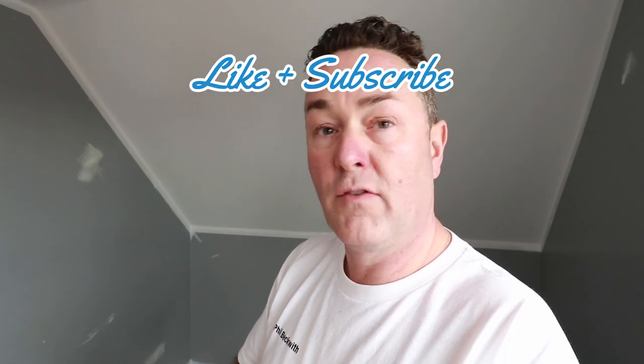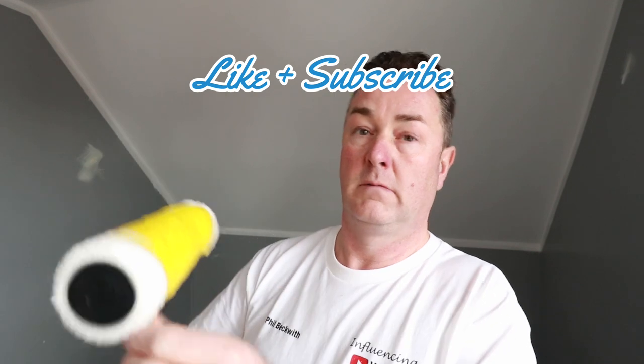Coming onto the walls, I'm going to try a different roller - I've got Two Fussy Blokes, and it's the semi-smooth 10mm nap, very similar to the ones you've probably seen in the video when I was working away in Europe using the 10mm and 5mm. A bit like the Nour - that was lint-free so I didn't do a washing out on that and it was fine, no fluff left on the ceiling. With this one I've wrapped some tape around it, and I'll just pull the tape off - if there's anything loose on the surface of the roller, it'll come off with the tape adhesive.